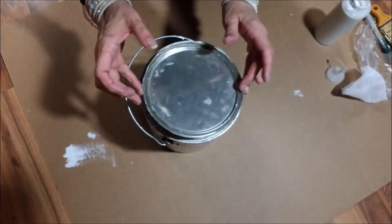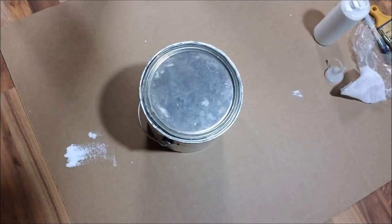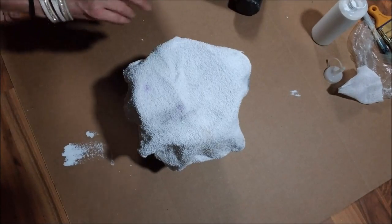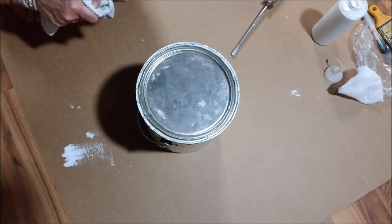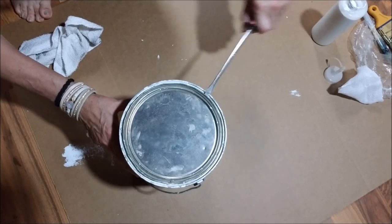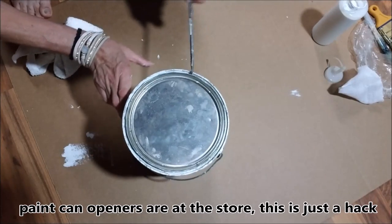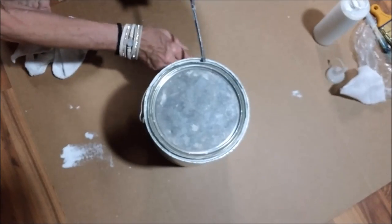Another thing — when you close your paint lid, there's a way to do it so you don't splatter paint everywhere. Just tap the lid on there, take a rag and put it over the lid, then use a rubber mallet and tap it down. Now you don't have paint splattered everywhere and the lid is on tight. For taking the lid off — a lot of people take a screwdriver and just pop it like this, but the best way is to stick the screwdriver in and twist it. That gets it to pop right off so much easier.